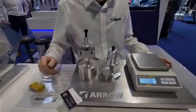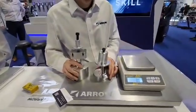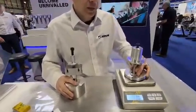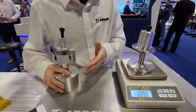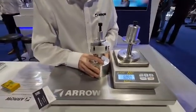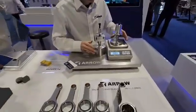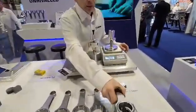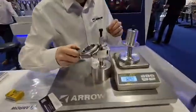Can you show us real quick one rod on the scale here — how you balance the rods as well? Yeah, we also — if we had eight rods here and we wanted to get them into four-cylinder sets, but they're all identical overall weight — we will group them by the big end mass, which is the rotating mass of the connecting rod.